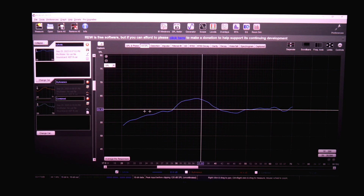This is a pretty smooth response. I measured from 20 Hz up to 70 Hz, which is about where my crossover is. It's not a bad line — 20 Hz going up to 30, not too bad. We have a little peak around 30 to 35 Hz, then it smoothens out from 35 on to 70, staying pretty linear. To calibrate this, I'd lower that 30 to 35 Hz peak to make it more linear, and raise 20 to 25 Hz by maybe 3 or 4 dB to smooth the line. Just don't go crazy with it.